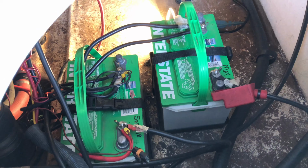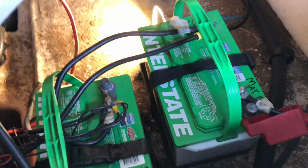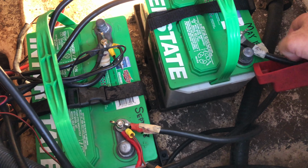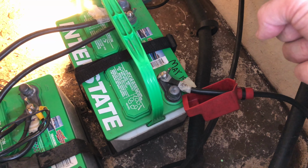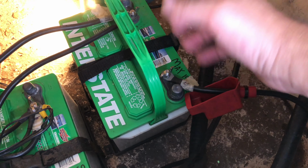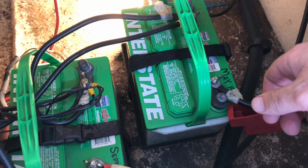Okay, we're back here at the rear of the boat, and I want to tell you what's next on my agenda. I'm not going to bore you through all this, but right here you've got these 2 batteries. Each of them has a positive and negative, and a few of them have multiple connections. I found in prior years it's best, since these are tight and you have to use some channel locks to get that wing nut off, to have a zip tie ready once you do, and just zip tie those connections together, throw it aside, and go to the next one. Then next season when you get here, you just pop the batteries in, and there's no frustration trying to figure out what goes where.